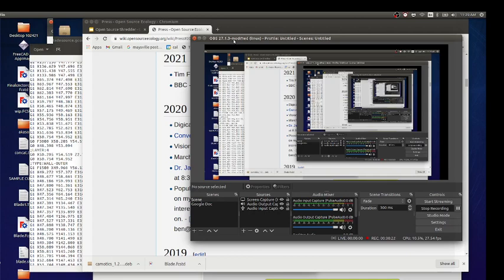We can go crazy and do up to that, but the basic idea is we have the capacity to automate with simple microcontroller scripts on Arduino, using the Arduino Mega we already have. We have a complete system developed for the controller itself for the brick press. So the valuable thing would be understanding how you go from giving it a command, run this cylinder, to actually controlling real devices to do whatever you want.